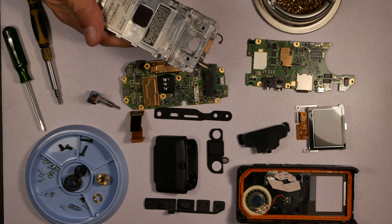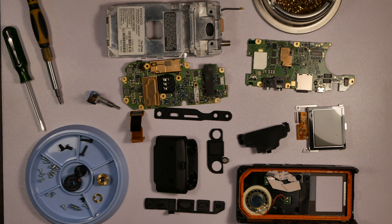That's every single piece. On the very top there's a GPS antenna still there, and there's the SMA connector. The GPS antenna is just double-stick taped on — you can actually just pull it off. I didn't take the SMA any further because I didn't see a reason to. I'll link to the other video when I post it that shows the test point connections, and there'll be a link to detailed pictures. Everything went back together and still works just fine, even after the other video you'll see posted.